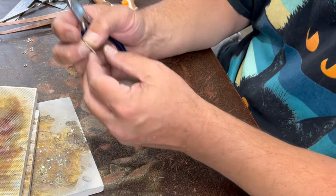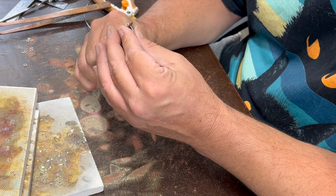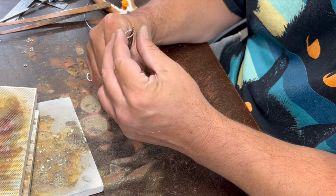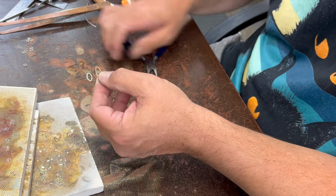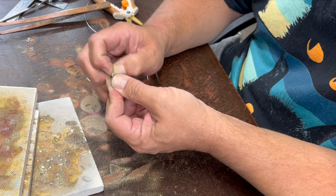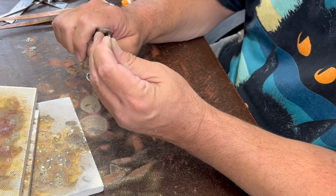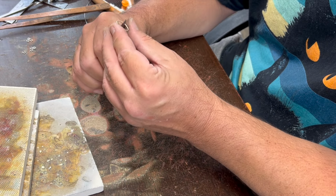Looking for. You could probably make this with a lot of variations to that shape. It doesn't have to be exactly this shape, I don't imagine. One thing that you'll note on this type of chain is that these big long links don't have anything stopping them from rotating when they're attached to these smaller rings. And a lot of chains, say this is the ring that we have on, this thing can rotate all the way around on those rings, so it's not going to stay necessarily in the same position. If you want that to happen, you need to put a stop on the end of these so that the ring can't rotate around the whole thing. And for this one, I'm not going to do that, but if you want it to not have as much movement, that's what you probably need to do.